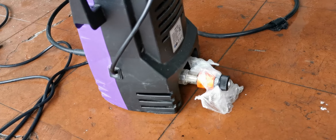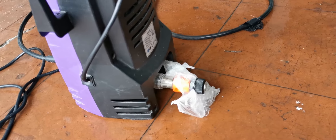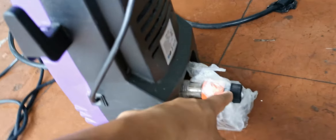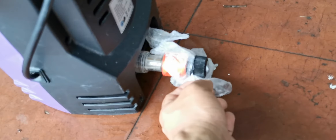Don't let that go on for very long, otherwise you'll overheat the pump and probably the motor as well, which will damage the pump. Also, this is where you connect the hose, so to keep dirt particles from getting in, I always put a plastic cover over it.